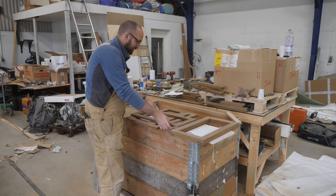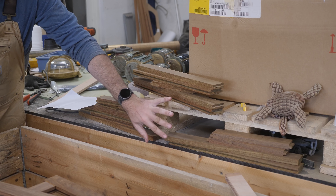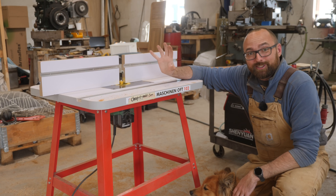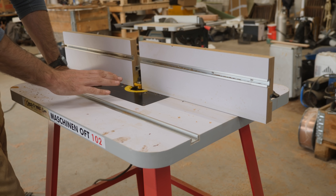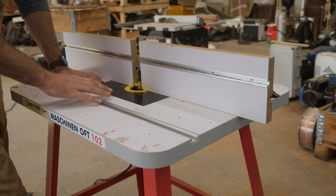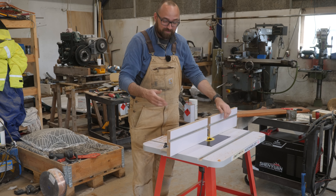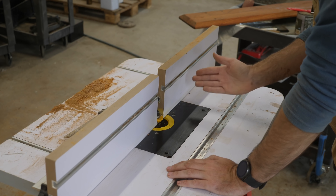These things are really starting to come along — I've got the three drawer fronts right here and the two doors for the area underneath the sink right here. Pay absolutely no attention to the pile of kindling back here — this is another complete set of drawer fronts that I completely messed up. The cheap automatic router table is, to be honest, a steaming pile of shite. I'm using a set of rail and stile router bits, and those require a little bit of precision which this router table is not good at. I'm having a lot of issues with repeatability — I can't get a consistent result. If I push on the plastic here I can actually see it move. Life is too short for cheap router tables.